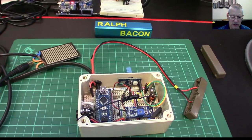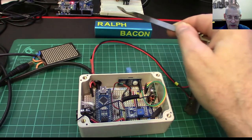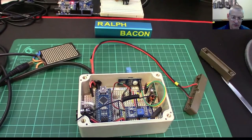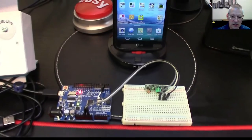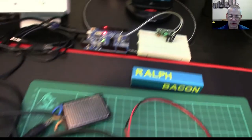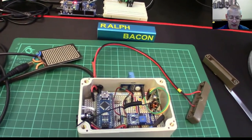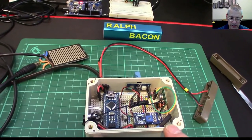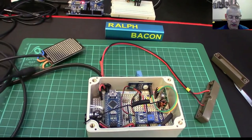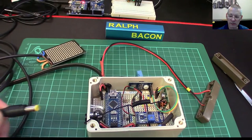Let me turn it on and look at the debugging window to see what's coming out. That bit right at the back there — where I'm pointing — that's an Arduino with the receiver. The original receiver is stuck down with Blu-Tac; I'm not going to move it. Let's use technology and move around. So that's the receiver — nothing's changed, it's just a very simple 'go and get me the data and display what you find.' I'm going to run this not with a USB cable but as it would be run outside, so I've got a nine-volt supply here.